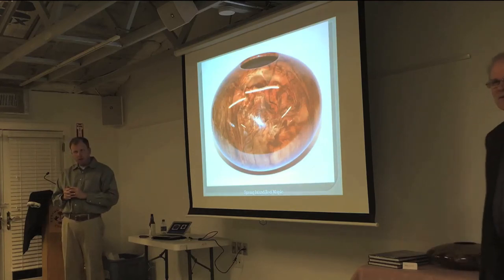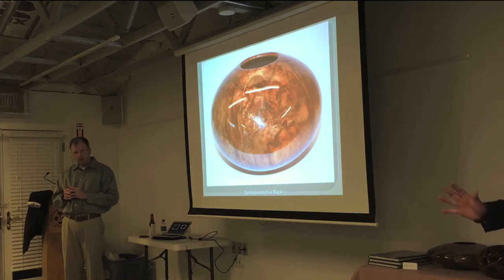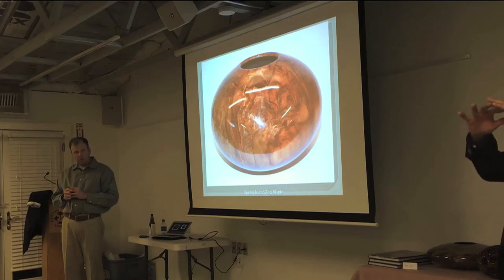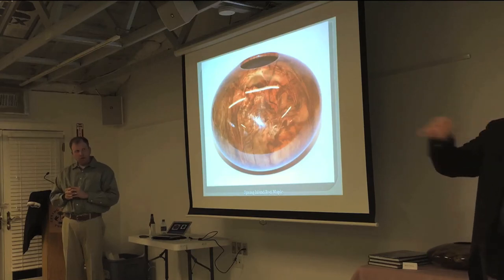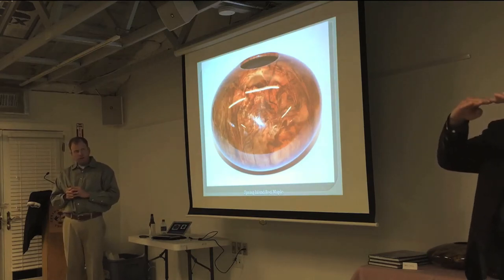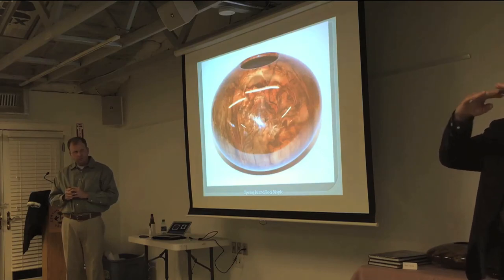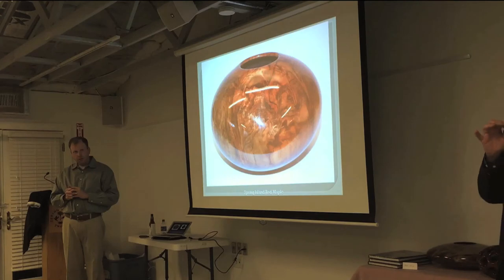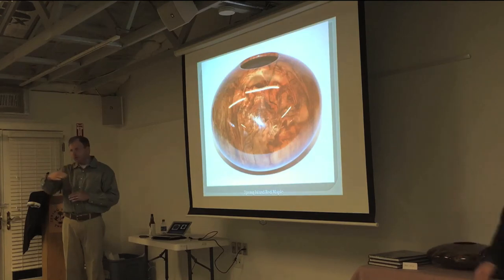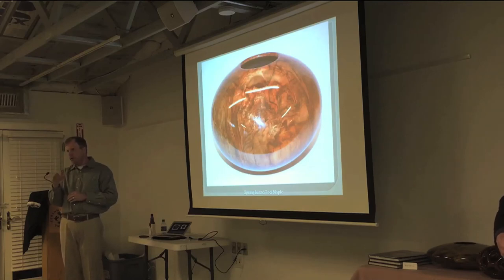So if you had one that just had lines in it and you turned it, would it just be little dots? Or how would it show up? No, usually it looks like they run over the top. And actually, at the end of the log, they'll look like they're going out like spider things this way. But when you curve it, rather than going out, they follow the curve. So they go all the way down the sides and you'll actually see the end of most of those little black lines. That's part of the fungus. It's a fungus. And it's part of the artistry is capturing that.